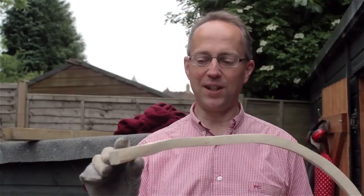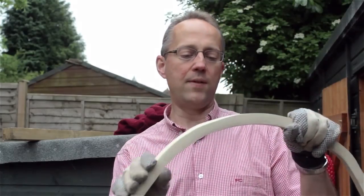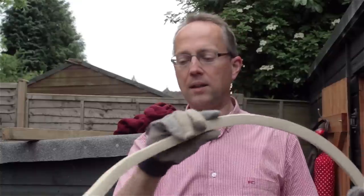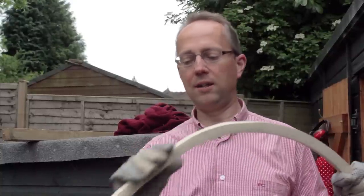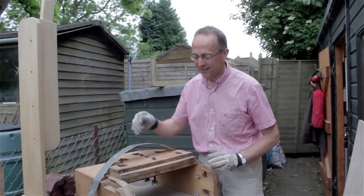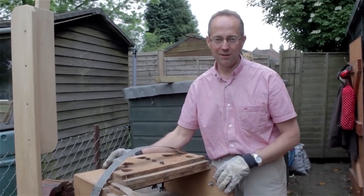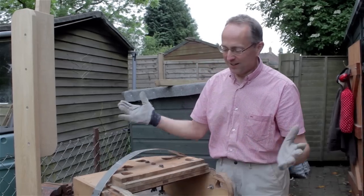Here's an arm from a continuous Windsor armchair — here's the lower bend for the lower part of the arm, and then there's the secondary bend for the curved back. This one was done in quite an old former. It's getting a bit cronky now, so I need to make some new formers to get nice smooth bends everywhere. My old bending former is getting rather flaky, bits are breaking up, and it is 20 or so years old, and I didn't varnish it as well.